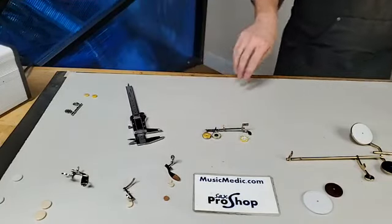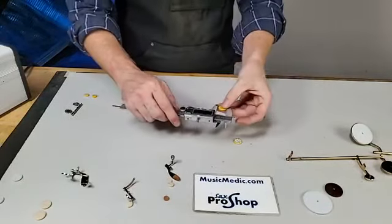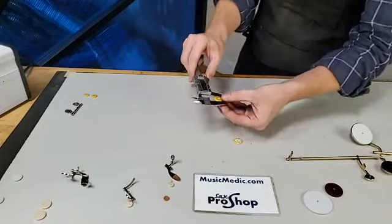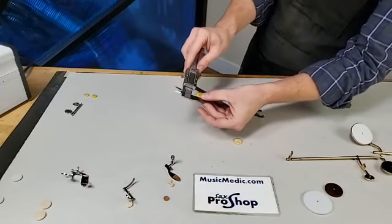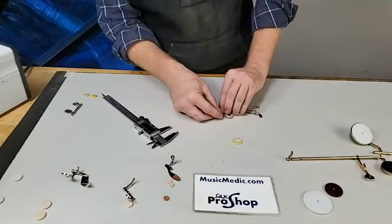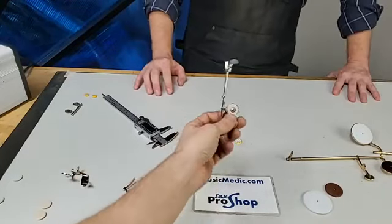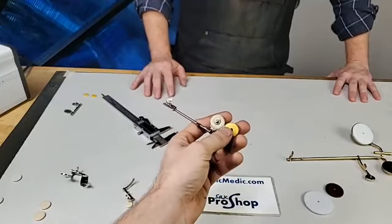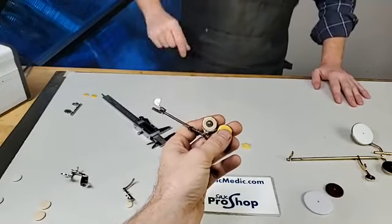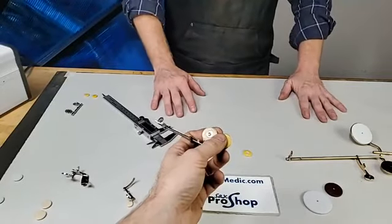Is that our 18.5? That, I believe, is. Yes, let's go ahead and measure that out. Flick that out. Actually, this is saying 18.43. So that's 18.5. Nice. So the 18.5 is going to give us a nice fit in the cup on this particular pad cup. So we had an 18 millimeter cup, but we ended up putting in an 18.5 pad. Is that right? Yes.